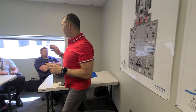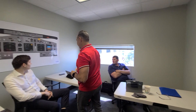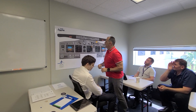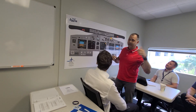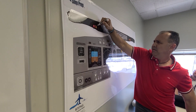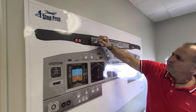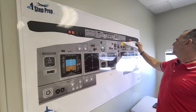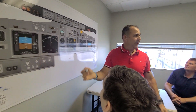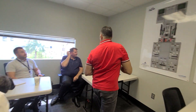When you do a fire and overheat test, you're going to get 11 lights if you have AC power. Which are the 11 lights? Remember, you start from left to right. So you're going to get: fire warning — that's one; master caution — number two; overheat — number three; master caution — number four; fire warning — number five. So five in the front, six in the back if you have AC.